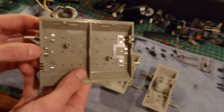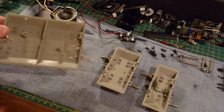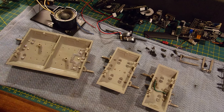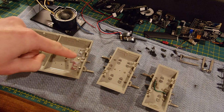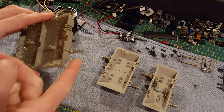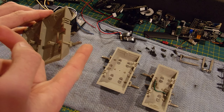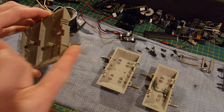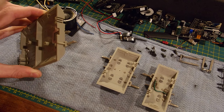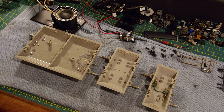It might be hard to see — if I bring it closer you can see better. There is a little bit of solder I've already put on this one because I've already experimented with it before. I'm only going to be soldering the center rails together because that's the only issue I've personally had — it's usually the power for the center rail that doesn't conduct between the rails. I've never had issues with the outer rails or the ground connections, as those pins are bigger so it's more likely for them to conduct electricity. Also, the center pins can sometimes bend, not be made of a good material, and overall it's just not the best design. So I'm only going to be soldering the center rails together because that's what I feel is necessary.